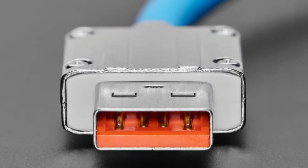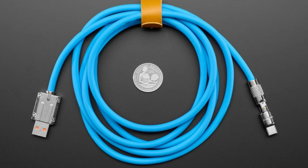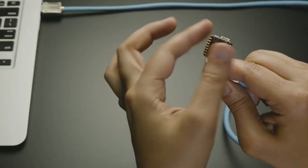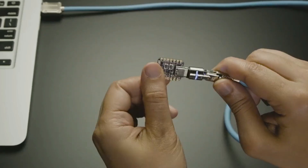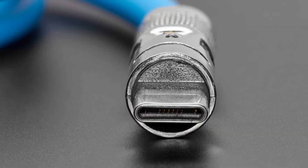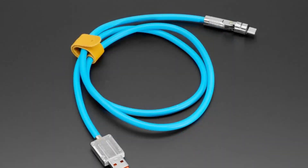There is a two meter version — they're kind of cyberpunk-y. They're USB-C on one end and USB-A 2.0 on the other, so they're not for ultra high speeds. That connector can only pass USB 2.0 signals anyway. It is both data and charge — you get all four signals through, and it works both ways so you can flip the connector. It's good for dongles too, if you have to move them around and tuck a dongle without pulling the cord.